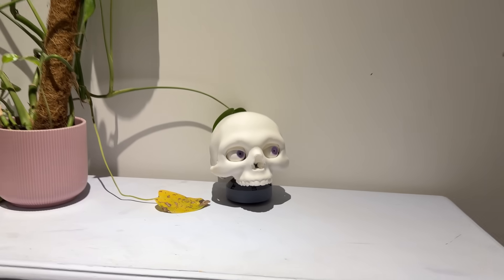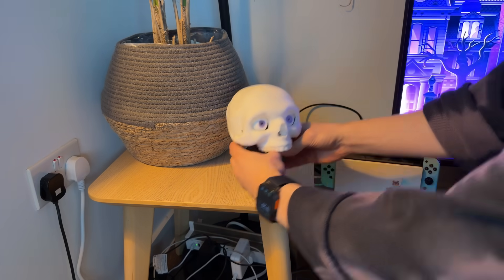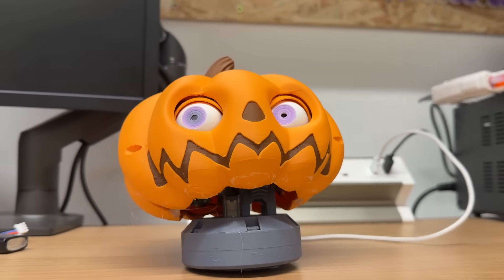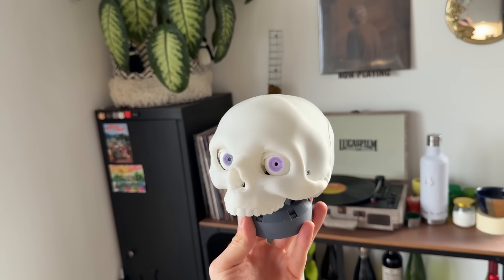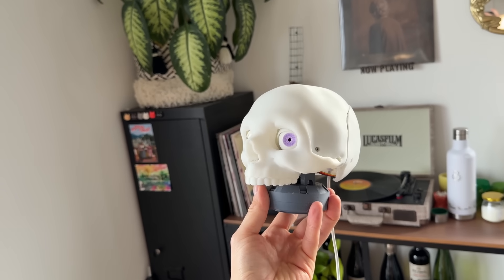Now you can put this anywhere — lurking in the hallway, by the front door, or hidden amongst the washing pile. To test the battery longevity and see how low the power consumption of the AI board really was, I left it running at full charge until it stopped working. In total it lasted about 15 minutes, which doesn't sound that impressive, but when you consider that there are five servos running constantly plus real-time machine vision in a battery that's only 800 milliamp hours, I think it's actually fairly impressive. It does highlight an important point though: the servos don't need to be on all the time. I can adjust the code so that when the mechanism is not moving — which is quite a lot of the time — the servos can be powered down and consume no power.